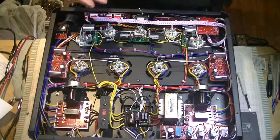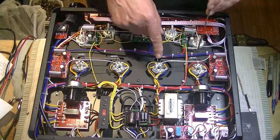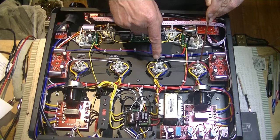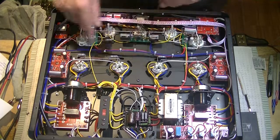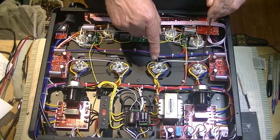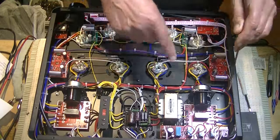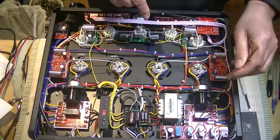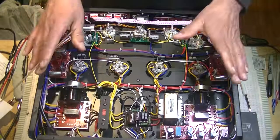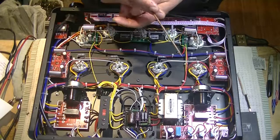Okay, so here we go. We've got our pair of right output tubes, EL34s let's say, and our pair of left output tubes. They're working together on that audio signal. We just talked about that. The two halves are being amplified. And they come over here, and underneath these boards here, I'm not going to take this apart, are the output transformers. And from there, the signal gets recombined.